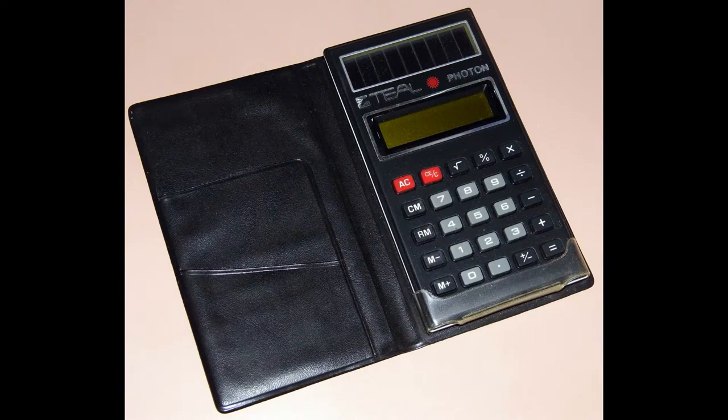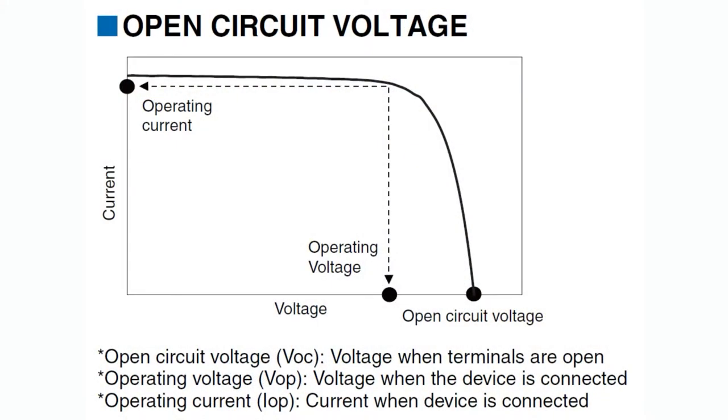If you can work within the constraints of the low current, you're good to go. For people who've never used solar panels, they're kind of weird because they're diodes running in reverse, basically. Instead of an IV curve going the opposite way, they go the positive way because there's positive power going out, not going in. And the operating curve does change with light levels.